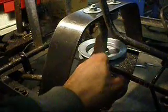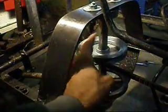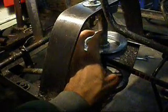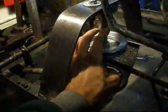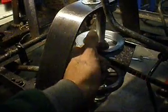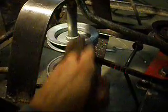The reason I made it a little bit longer like this, where the bearings — the support here could have come down lower — is that if I was using a thinner shaft I would have made it shorter, but that's why I used this three quarter inch: so I could make it longer so that the pulleys can slide up and down on the shaft. If I was going to use a three-tier pulley back here, I can adjust my speeds on that belt and adjust my tensioner over here.